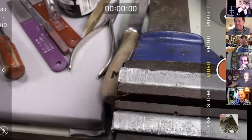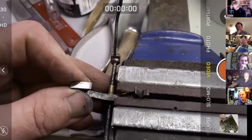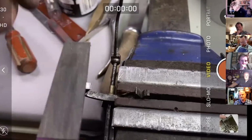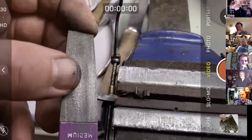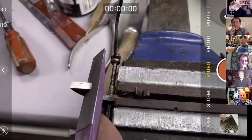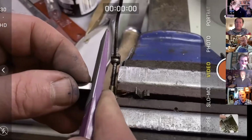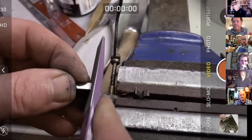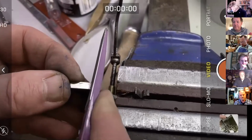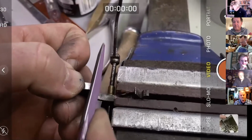I was worried that I was beginning to file down onto the pallet frame, the original frame, but we're not. We're about 0.1, 0.15 maybe of a millimeter off that, which doesn't sound like a lot, but it's enough. You can see the diamond hones getting quite burnished, but according to the manufacturer, they're still sharp. So put it on the inside there against the old pallet frame, knowing that that's where I don't want to cut, and then just tilt the tool around a little bit. Right. More stoning or honing or whatever it's called. And incredibly, the thing hasn't fallen off yet. So, miracle.